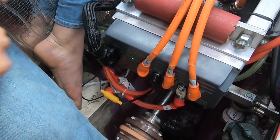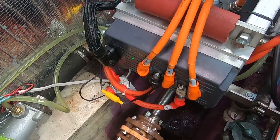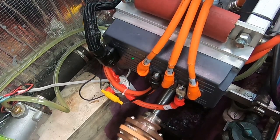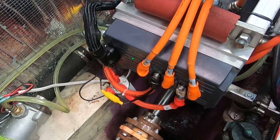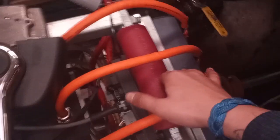That is odd — now we have an error code. It's like it's forcing back when I try to move it; it's really hard. When it's not engaged, it's super easy to spin. It's forcing against itself in both directions. It sounds like an encoder issue. I've tried the sine-cosine cables in pretty much every position possible and it does not work. Back to square one.